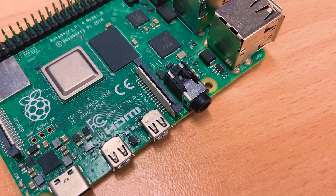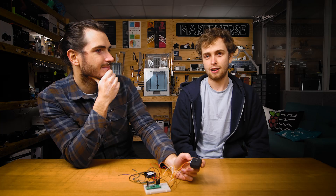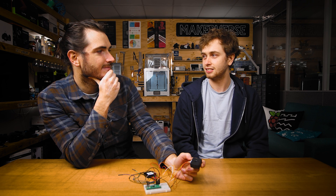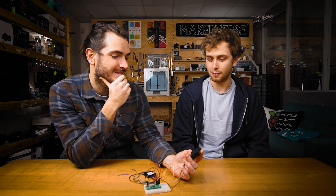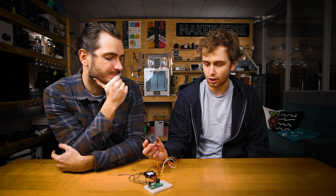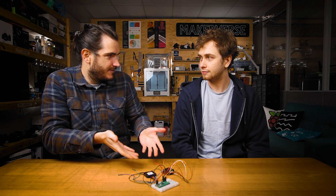For the Raspberry Pi, it uses the CSI connector and the base protocol for that is MIPI — it clocks data out very fast at about 1.5 gigabits per second. That's way too fast for a microcontroller. There are some other cameras that use SPI and I2C but they're not as versatile as the Mega. This is kind of the first camera that uses just one protocol and has a nice range of features — and that protocol is SPI.